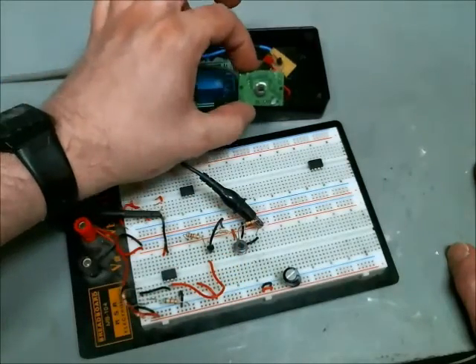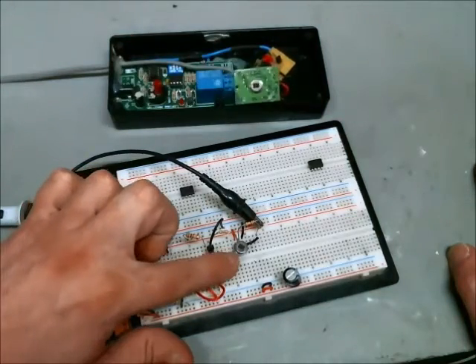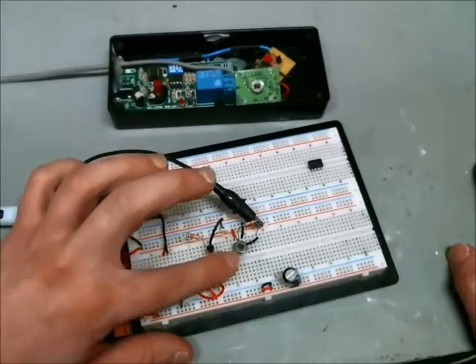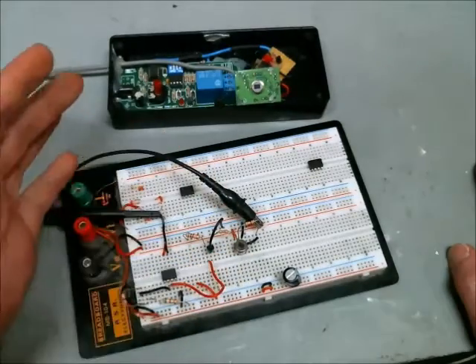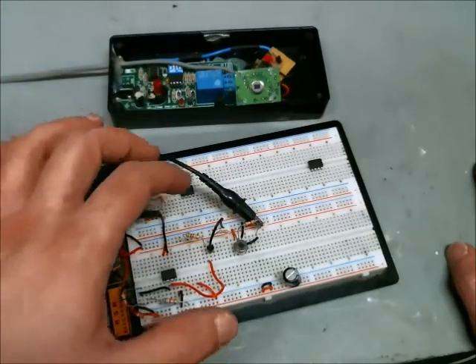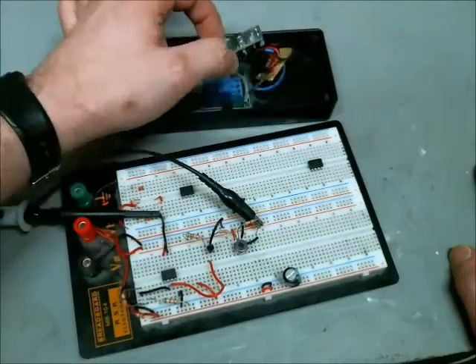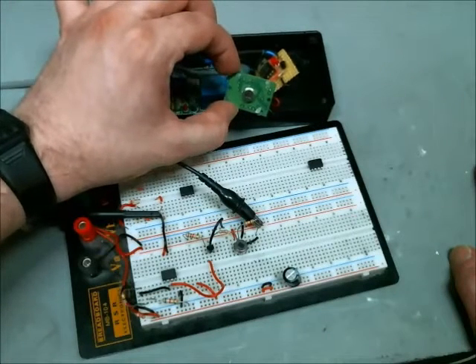This module was $15 at Radio Shack — I believe it was made by Parallax. This one I got for $2 at IC Station. It's a little more work to use just the sensor, but the advantage is you can make your own amplifier and do all of the sizing yourself, so you can really customize the size and dimensions. If you use the module, you're stuck with the dimensions they chose.